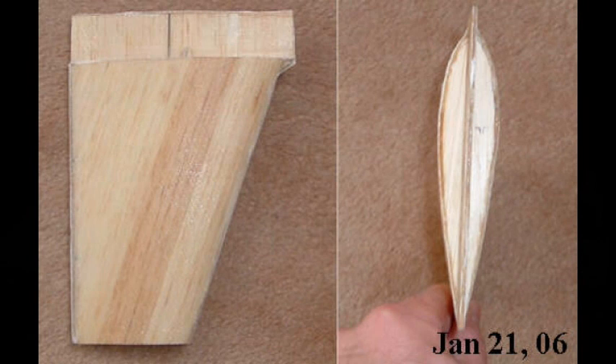When that was done, I cut out molds for the desired foil shape and glued them up down the length of the keel stub, then planked the outside surface of the keel with 1/16 by 3/16 inch balsa planks. When I finished doing that, I sanded it fair and fiberglassed the outside again with two more layers of 6-ounce fiberglass set in epoxy. After that I opened up the bottom of the keel stub for about an inch and filled it with thickened epoxy to give myself something to attach the bulb to. What I came up with was a very sturdy keel fin.